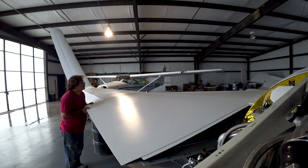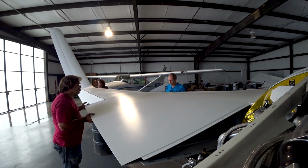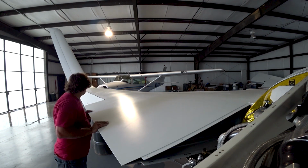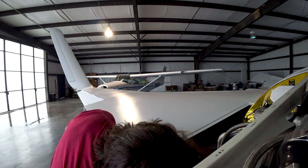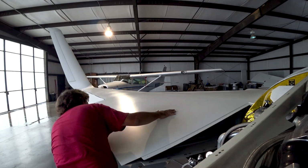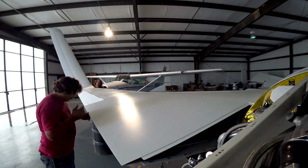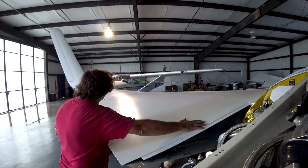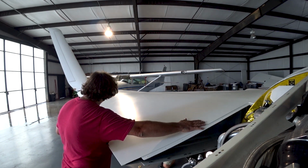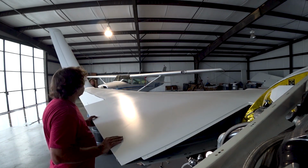And a few other things that I got done as well during the week, just up front, tuning things in. I had to replace one of the pressure sensors on the engine. The one on the first turbo for some reason just stopped working, and it was kind of like a Motec sensor. So I replaced it with one similar to the ones we're using for other pressure areas on the engine, and that one is now working, so I'll have that back in shape.